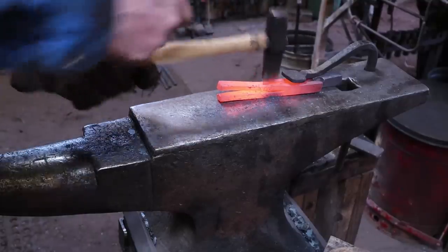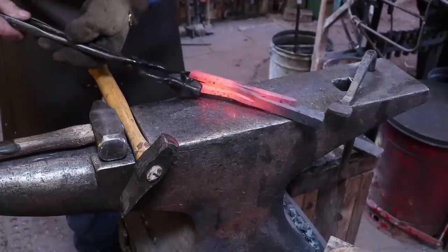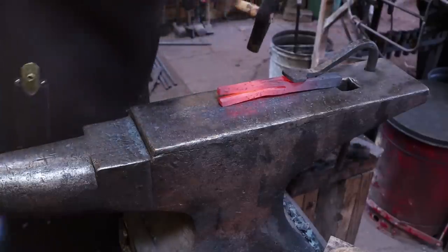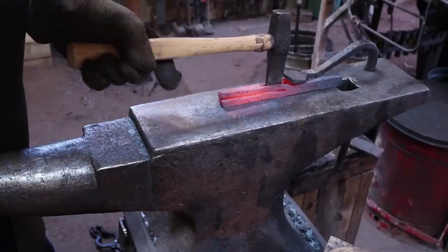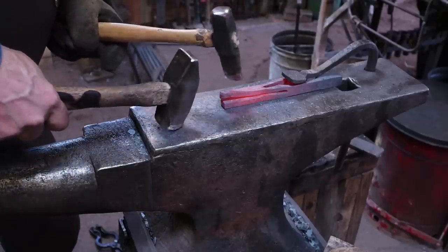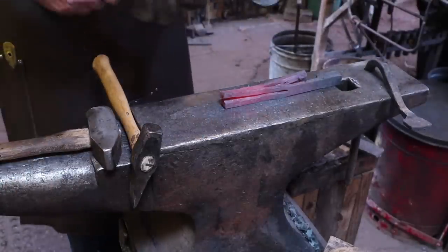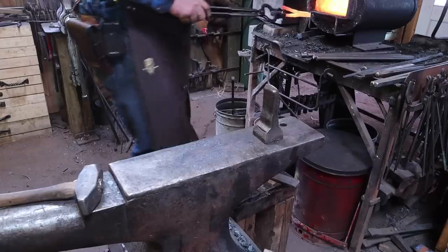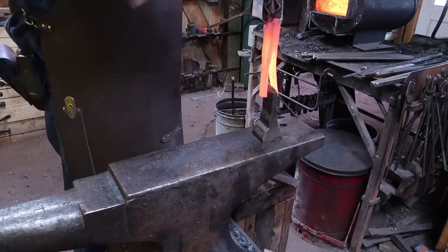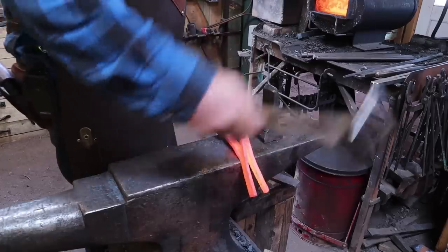As things start to split open, it gets really hard to keep things straight and in control — all the little bevels from the chisel are sliding past each other in different directions, but just do the best you can. Inevitably there are going to be some little burrs on the inside that you'll need to correct with a file or grinder later. We want to come back from this side and make sure that's cut all the way through, and then we'll be ready to open it. Some of this opening happens through spreading with this big hardy, or you can put it in a vise and use your chisel to start spreading it, and some of it happens just by bending it over the edge of the anvil.